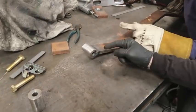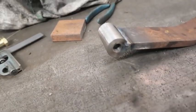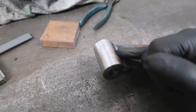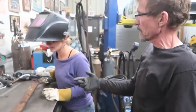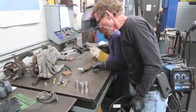She does got it. A little bit of a bebop in the middle, but other than that, you've got the speed down pat. That first half right there is perfect. I mean, perfect. And there's nothing wrong with that weld in general. Even with the zigzag? Yeah, that's fine. That's more of a how it looks thing than anything. And it's on top of your tack fine? Yeah, that's fine.